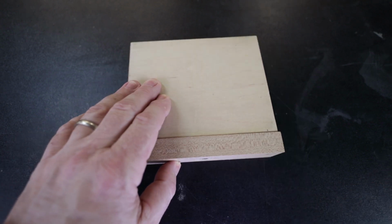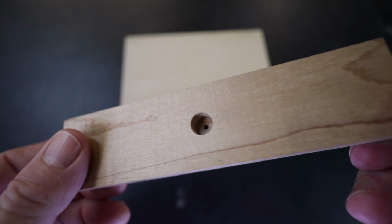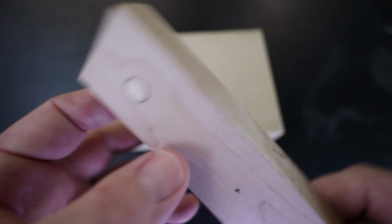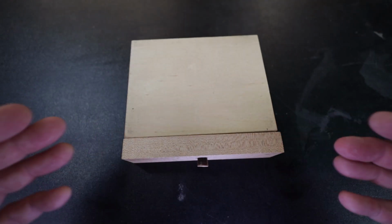I don't have enough clamps, so I am going to drill a 3/8 hole every so often, also a pilot hole, and then screw my boards off and cap them with plugs. And my plug cutter burns the outside of the plug, which makes an obvious circle around it. So I have to put my screws on a halfway decent layout because you can definitely see them.